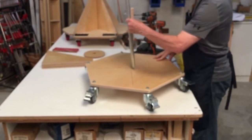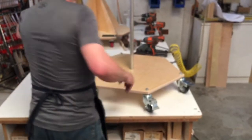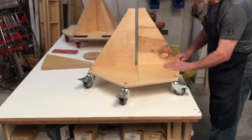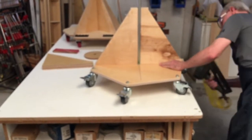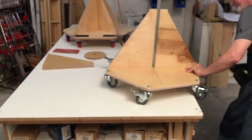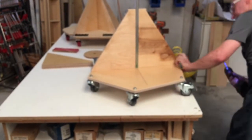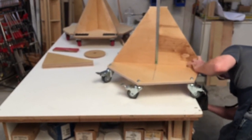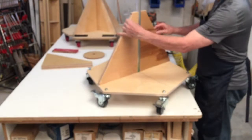We're going to get our piece of tubing, put it in there, and put our opposing member on there. Line it up with our indicator marks — there will be four of them and you just split those marks on each side and you are in position, in the right place. Tack it a little bit — looks good. We're going to put a screw in that. We'll only put one screw in this one and the rest of them, the other two as well. When we are happy with everything we will go ahead and tighten everything up with the rest of the screws.